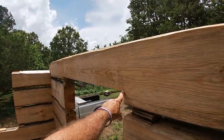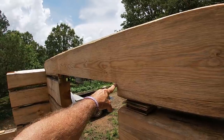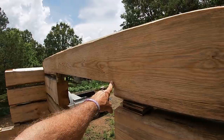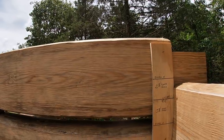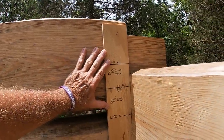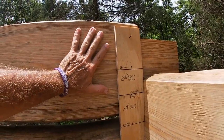I wanted to explain to you how I knew how far down to come from the center line to get this cut out. I needed 41.5 inches from this point to the bottom of where the cutout is for my opening to allow for the settling over the window. And I just tacked a piece of plywood up here. Now this, I did before B wall was up here.